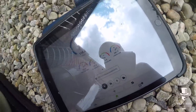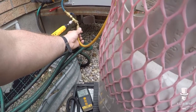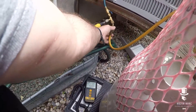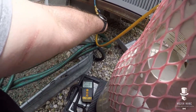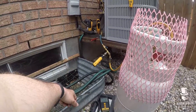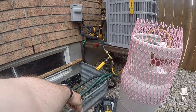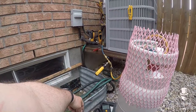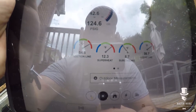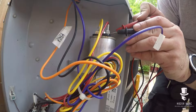Let's go outside and bring that superheat down — probably just needs a couple squirts and we're okay. Superheat is a little higher so we'll throw in a bit of gas. Of course you don't want to overshoot it — couple more squirts. Looking good so far. I'll check the cap before I leave — sometimes it's just user error, especially with those fancy thermostats. Superheat's dropping nice.